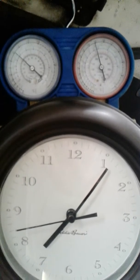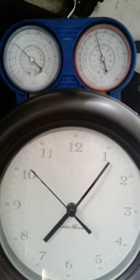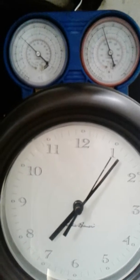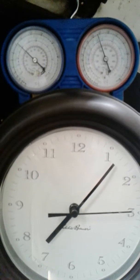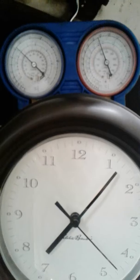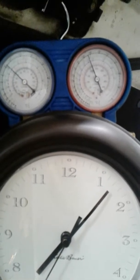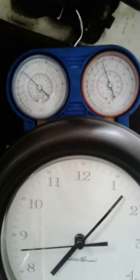The compressor has been running the entire time. Fan speed increased — I can definitely feel the high speed fan kicked in. We're down to 220 psi. Low pressure is about 38.